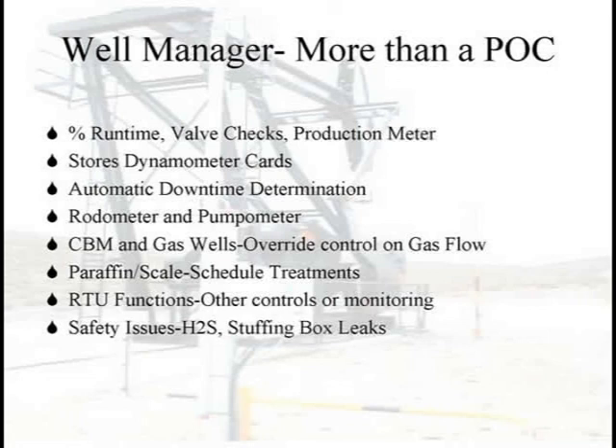We've also been looking at everything we're doing with coalbed methane. We've got a great product to move fluid, but what do you do about gas? On these coalbed methane wells, maybe 15 minutes was a good downtime, but then in one cycle at eight minutes of downtime, we had enough back pressure that we killed the gas flow. We're pumping water, but the revenue is the gas. So we've added features where you can monitor your gas flow — if the gas flow falls off during your downtime, it'll kick the well back on to get that fluid off and let the gas start flowing again.